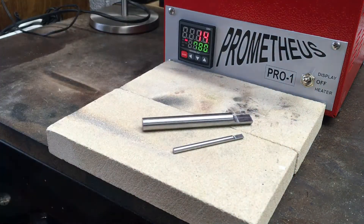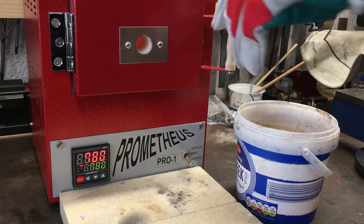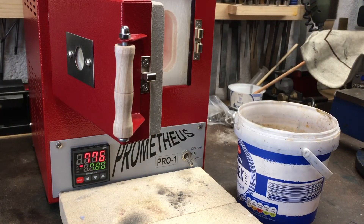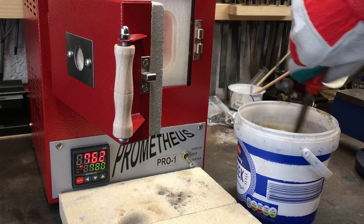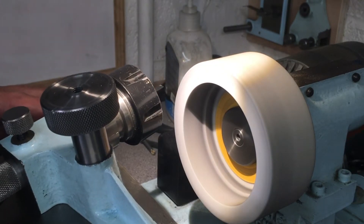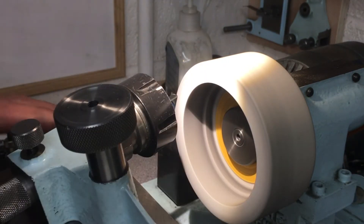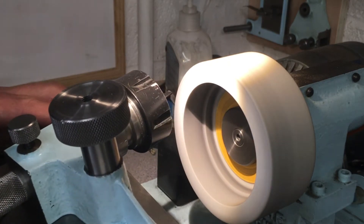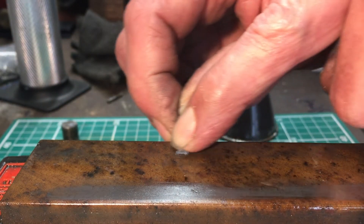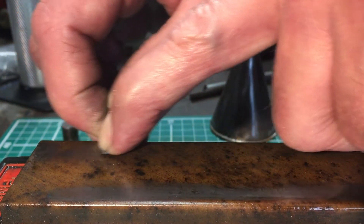Now for something a little more precise — here we have a couple of D-bits which have been machined pretty close to their finish size. These were heated for the required amount of time at the right temperature, then quenched and tempered — actually they were tempered in a domestic oven. One of them is just being touched up on the grinder; very little needed to come off because most of the hard work in shaping had been done before the hardening process. After grinding, just a gentle stoning to refine the edge and it's ready for use.